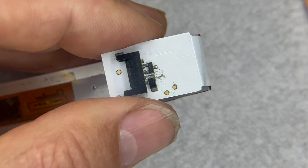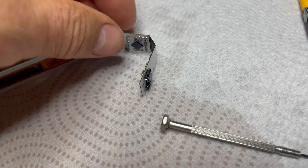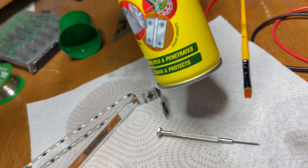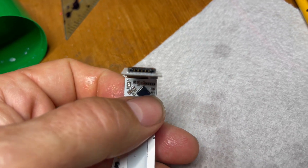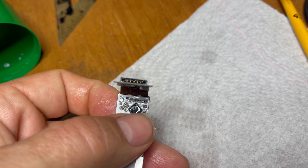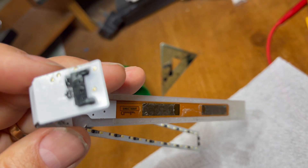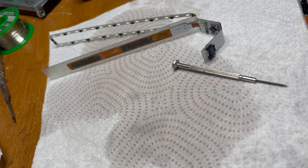I used the smallest micro little screwdriver I could find to get in there. If you want some precision screwdrivers, have a look at the video description for buying links. Look carefully for that sort of occurrence and get rid of it. Sprayed it with sufficient maintenance oil — WD-40 type oil — something that's going to expel water. It says it dispels moisture somewhere on there. Lots around that connector, also got a little screwdriver into the end of the connector and scratched a little bit in between the contacts, then sprayed in with the oil as well.